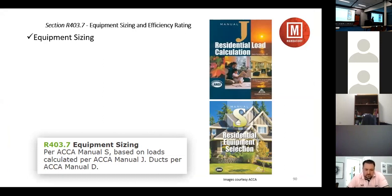It's fiberglass, but it's blue. Do you see cellulose at all for that? I have rarely seen cellulose. I don't see cellulose much anymore except blown in attics, and I'm really not crazy about cellulose. I had so many people complain about dust in their house from cellulose insulation because it came in through the lights and everything else. I put in air cleaners and stuff, but you can't stop it because it just keeps coming in. Do you have a comment? No. Okay.